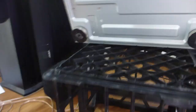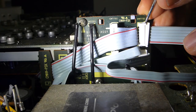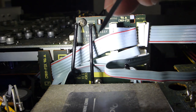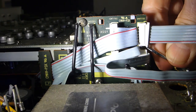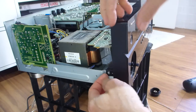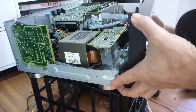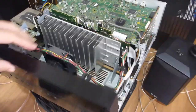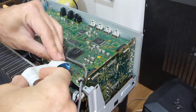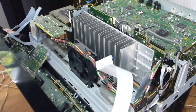There's a whole stack of screws along the bottom to remove. The top tab is easy to get out with a thin blade screwdriver. The bottom one I'm using a sharpened nail to lever out. Once all the bottom screws are out you can lift the tabs and the whole thing slides forward. You'll have to pull off some cables — there's a ribbon cable on this side. Lever the connection, walk it up each side until it pops off. With those two connectors and the ribbon cable out, it can come out enough to access the rotary encoder.